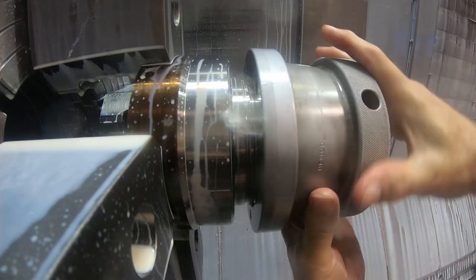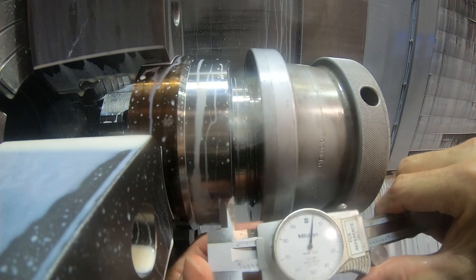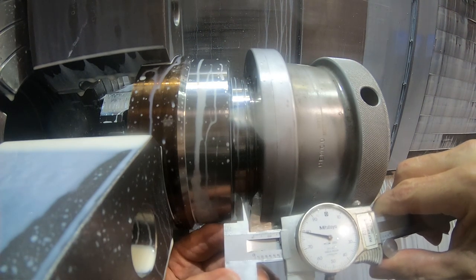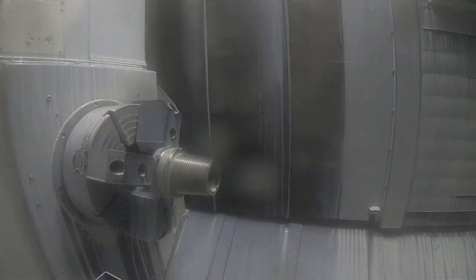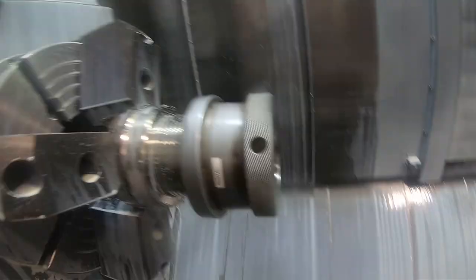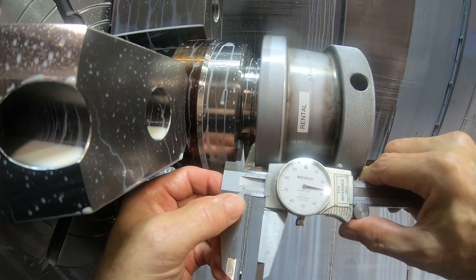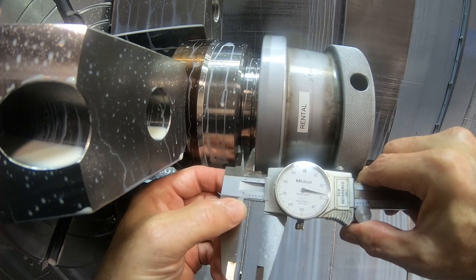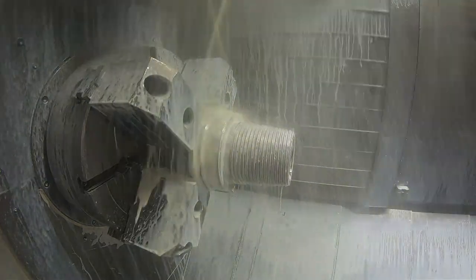I intentionally stood off the offset so that it would gauge long here. And it's measuring about 680/1000ths, if you see with the caliper there. So that's about 55/1000ths long. And it moves about 12/1000ths per 1/1000th on the radius, so that ended up being a little more than 8.5/1000ths. I reran the thread and checked the gauge length again. It's running a couple of 1/1000ths bigger than the ideal size, but there's plus 10/1000ths tolerance on it, so I'm not going to rerun the threading tool for that. It would hardly take anything to take that off anyway, so it's very little.